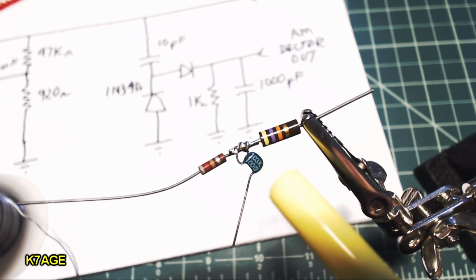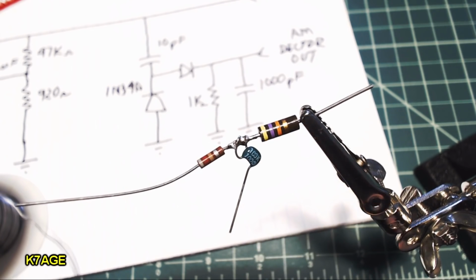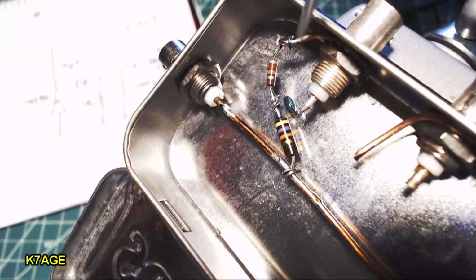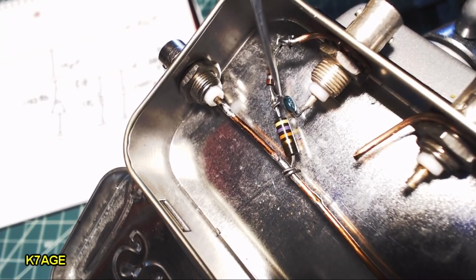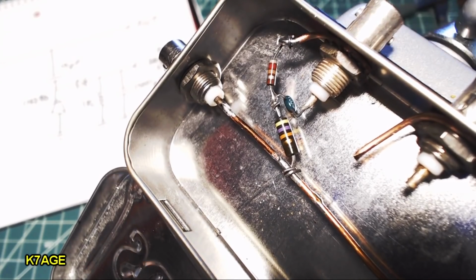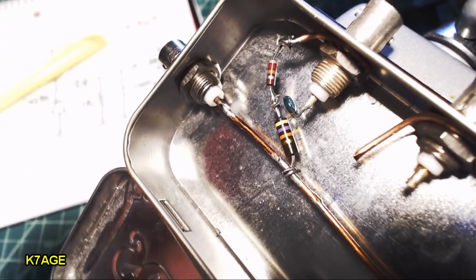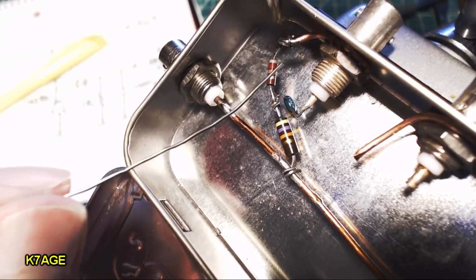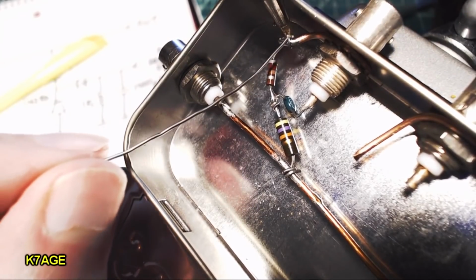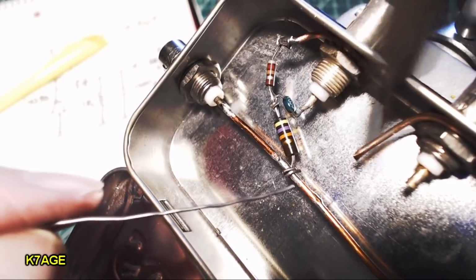So I soldered the 2 resistors and the capacitor together by wrapping the capacitor's lead around the resistor lead. So that's ready now to install. Okay, so I've got the parts in the box. I've taken the leads of the resistors on each end and wrapped them around the wires here, so they haven't been soldered yet. And the capacitor down here, it's formed up and ready to solder there. So I'm ready to get in there with the iron. And since this is a lot of heavy soldering, I fired up my little fan here to keep me from breathing this stuff in. So let me get in here and solder this resistor. Here we go. That one took nicely. It helps tinning these wires first.